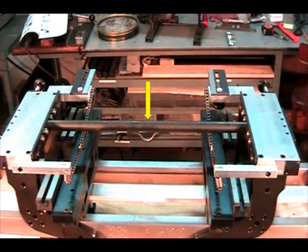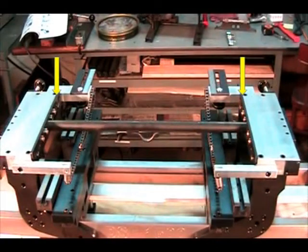Install the lifting bar in the middle of the fixture with the center holding pins extended. Tighten an additional one half turn after the datum plates touch the lifting bar. Mill or grind minimum off the datum plates. Each time the fixture is removed, the datum plates need to be machined to ensure accuracy of the fixture.